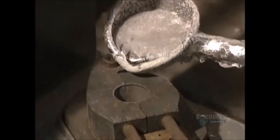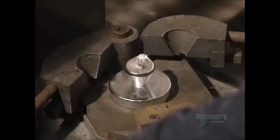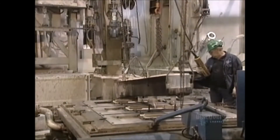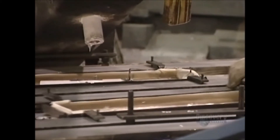The fusion temperature of aluminum is 660 degrees centigrade. A portion of aluminum is poured into a small mold to make a sample. Solidifying in just seconds, the sample allows for testing to verify the contents of the prepared alloy. A trough is used to transfer the aluminum from the re-melting furnace to the tapping well, where impurities are filtered out in special receptacles.